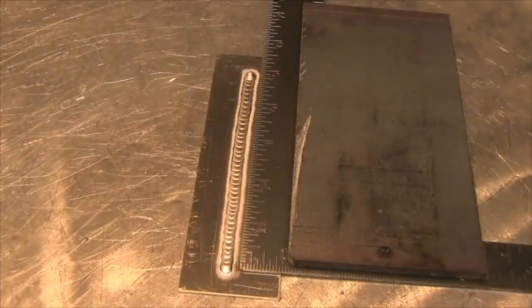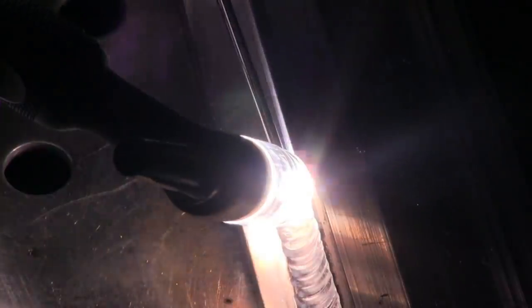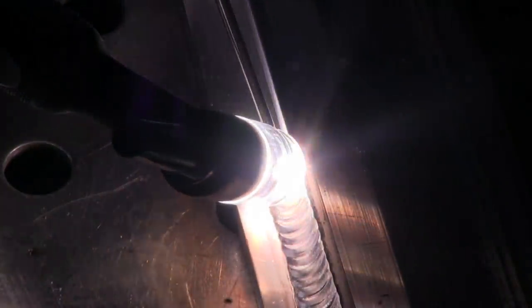The number eight is rated for AC or DC - none of the other big cups with wire screen diffusers are rated for AC, but this one is. You can get it at weldmonger.com. Here's a shot using a machine that has advanced pulse, where the machine alternates between electrode negative and AC. When I cut and etched this, I got some really good penetration. Maxed out at 200 amps, the cup did a great job.